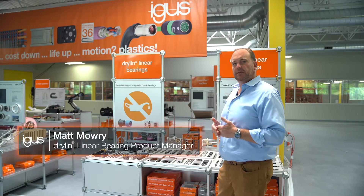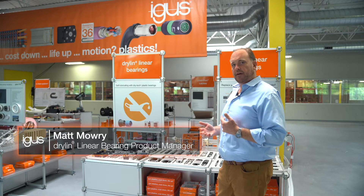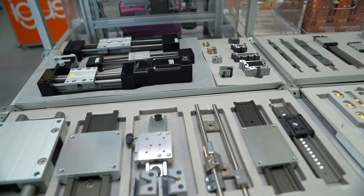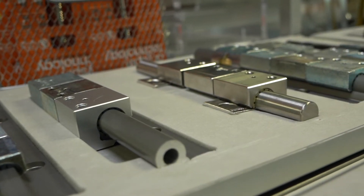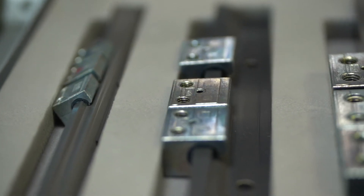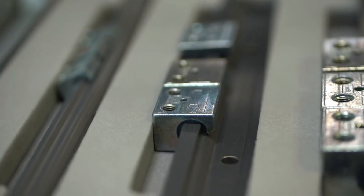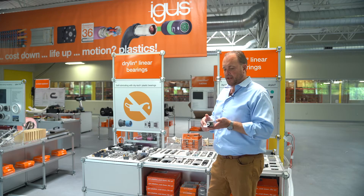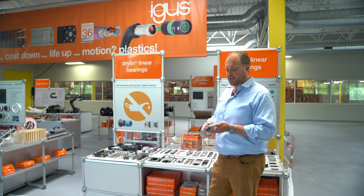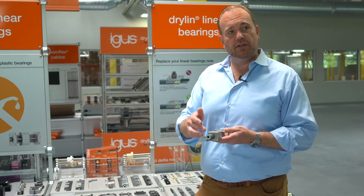It's available in size 6mm diameter all the way up to size 25mm diameter. There's a lot to go through and I'm going to try to keep this short and concise for you. Two main designs: a single rail version and a double rail version. A single rail is used just like a lot of other linear guide rails where you need two for an application to mitigate the swinging around the moment of travel. This series we have both in round and square.